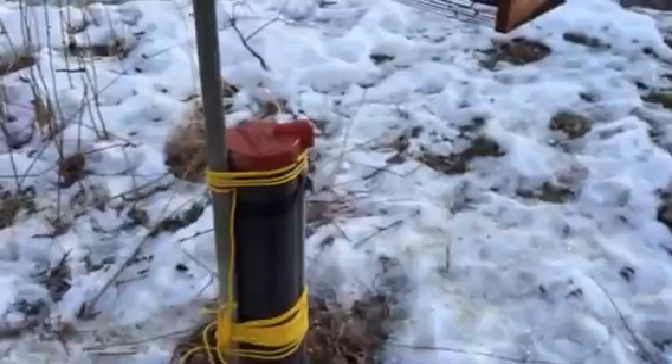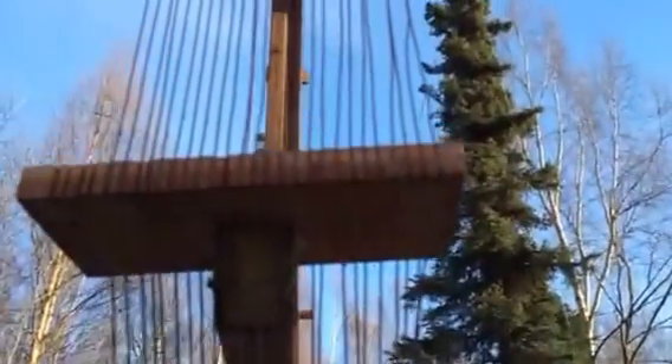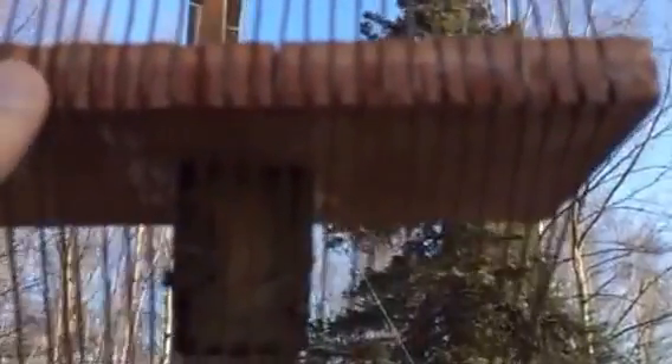I'm sure that's probably not legal, but anyway. The antenna is a 25-turn loop using 20-gauge AWG stranded wire insulated on quarter-inch cutout grooves here in some cedar, which has been prepared and yacht-varnished to protect the turns.